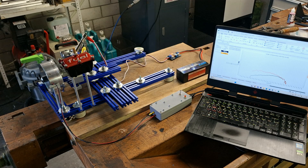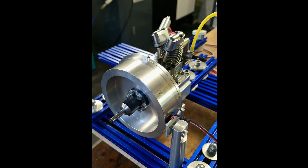Let's take a look at how I implemented this principle in my dyno for model engines. The biggest difference is that I don't drive rollers with my engines — I use directly the flywheel for this purpose. The flywheel is therefore significantly larger than it would be when fitted in a model. The inertia of the flywheel is selected so that typical 6.5 cubic centimeter four-stroke engines achieve a ramp-up time of approximately five seconds.